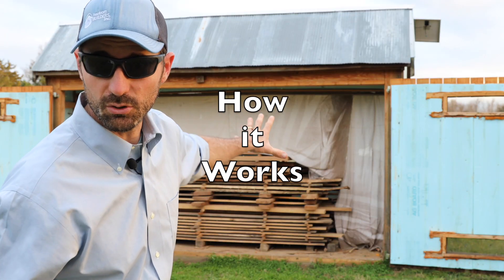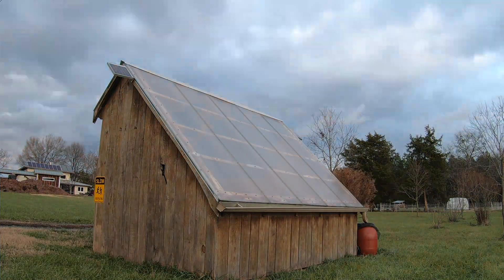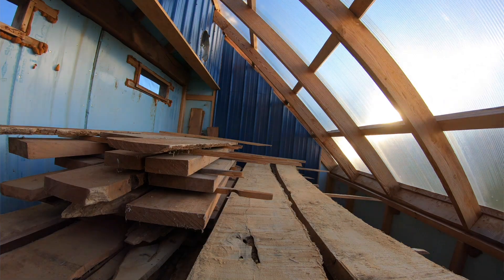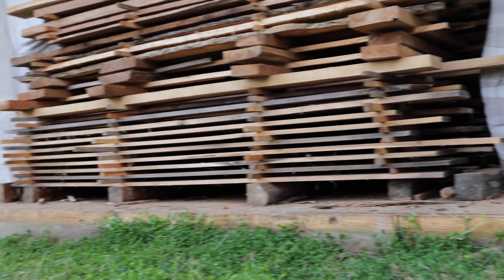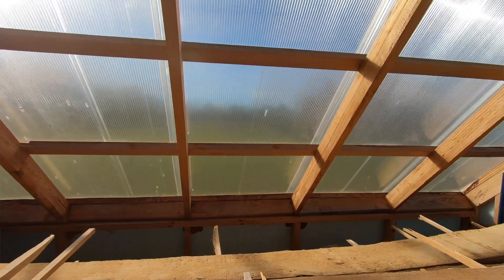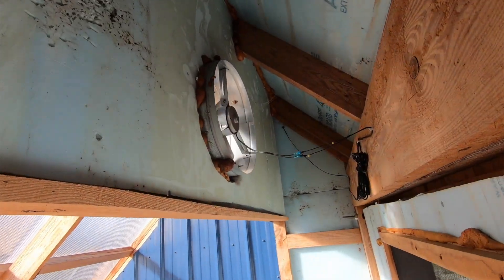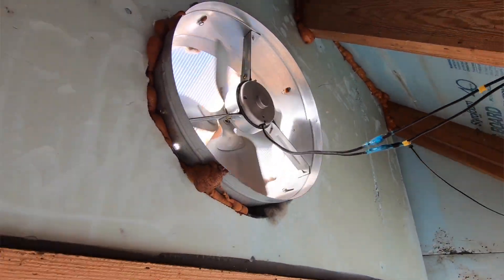Here's how it works. This solar kiln is a passive energy workhorse. In the last six years we've dried thousands of board feet of the most beautiful lumber right here for free. It saves a tremendous amount of fossil fuel energy by using the sun to evaporate moisture from wood, making it even higher quality and more stable and reliable than standard kiln dried lumber. The solar kiln collects and intensifies heat from the sun to dry lumber — it's basically a greenhouse with fans placed strategically to move hot air throughout the stack of lumber and remove that moist air as it evaporates from the wood.